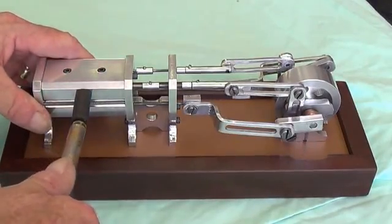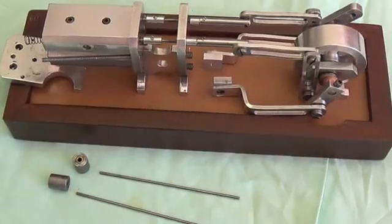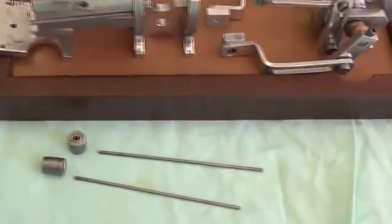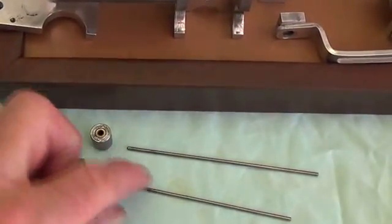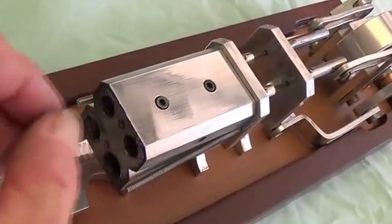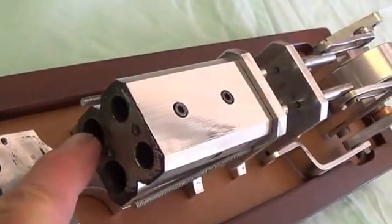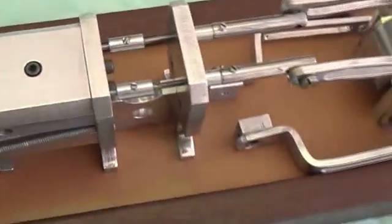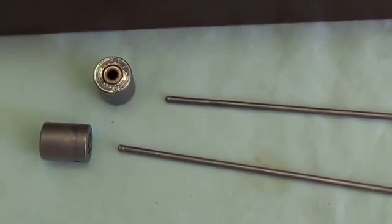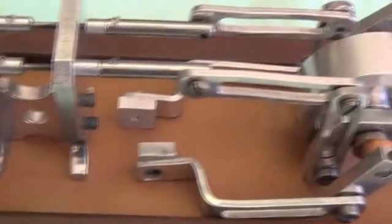I can't get over it — I've got to do it one more time. Well, sadly, we had a casualty. After the two-cylinder steam engine ran and then suddenly ceased running, both the pistons broke loose from their connecting rods, so I had to pull the back out of the engine. These are the springs that return the valves forward, keeping pressure on the cams. Both of the pistons broke loose, so I'm going to have to come up with some sort of a stronger connecting rod and reassemble this beast and we'll do it again. So it's down for now, but it's not out.